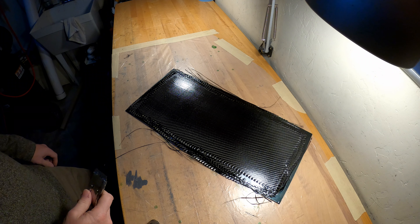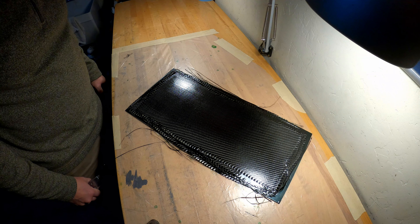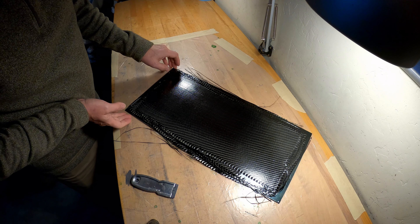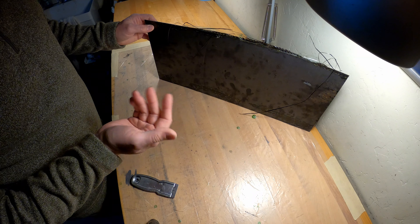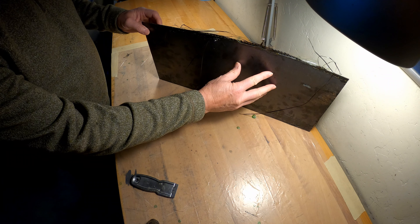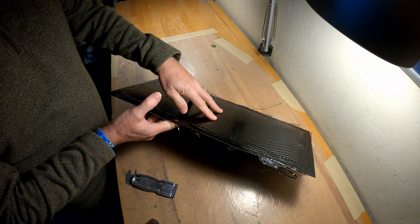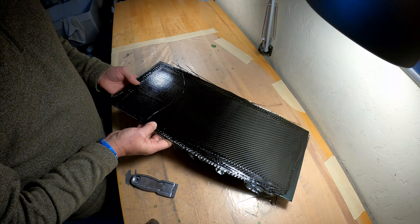Here we are — it's the next day. This plate has been heated until about 9 PM last night at about 100 degrees, just to ensure a good cure since I have uneven heat in the garage. It is currently 16 degrees outside. One of the benefits when you have a piece like this — aluminum is best, this metal plate is second best. I stuck it outside in 16 degrees and what happens is all the metal contracts. The coefficient of thermal expansion is different than the carbon on top of it, so the metal will contract more than the carbon. Carbon is more neutral.